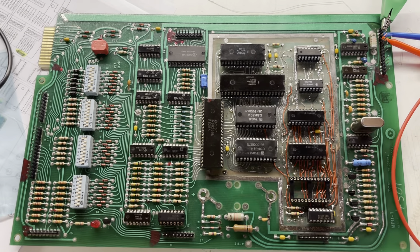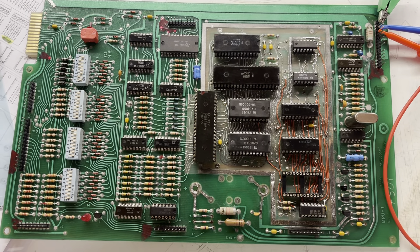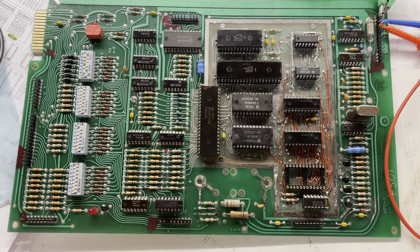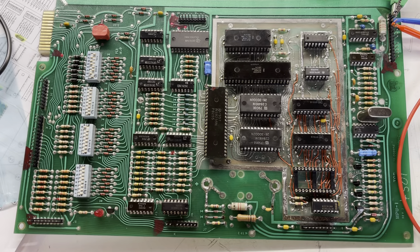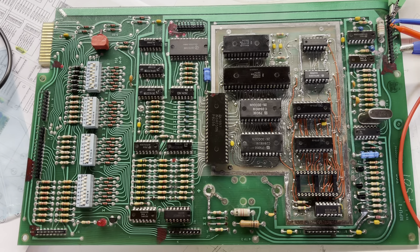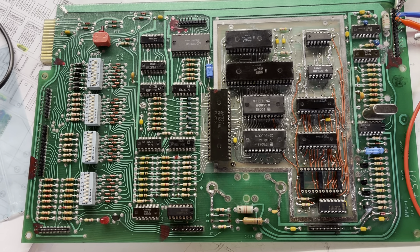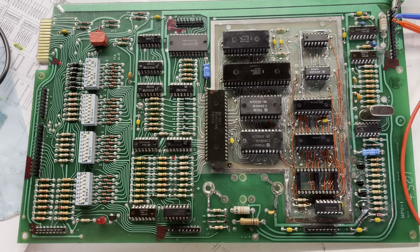So here's what we're going to do. I'm going to turn on the bench supply here. We're going to look for one flash in the LED in the bottom left-hand corner. And that's good news — we got one flash. That means it's loaded the operating system, and let's just test it to make sure it can get through its clear boot process. 3, 4, 5. We've got a working Game Plan board.